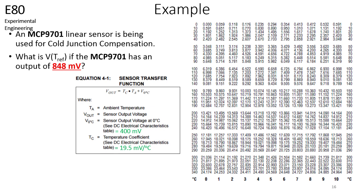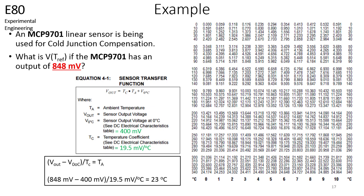Let's go over an example that demonstrates how a linear sensor could be used to determine the thermocouple voltage at the reference junction. Suppose we are using an MCP9701 integrated silicon linear sensor to measure the temperature at the cold junction. The MCP9701 has an output voltage of 848 millivolts. The first step is to convert the output of the MCP9701 into a temperature. Using the equation and data provided in the datasheet, we can easily convert the output voltage to a temperature of 23 degrees Celsius.